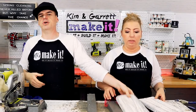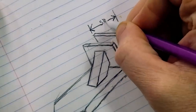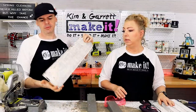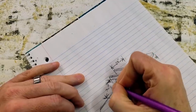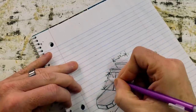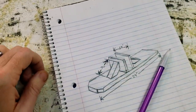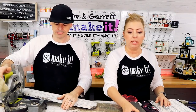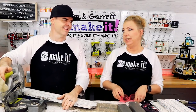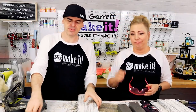We're gonna take this one and chop it up so it's 5.5 inches wide. We're gonna get 4 of these out of this one, I hope. We'll see. And then we're gonna use part of the 2x3 that's the back brace. We're gonna cut this to use it as a 45 degree brace. So again, it's all part of what we've already used for the rest of the project. Just using our leftovers, making the most.